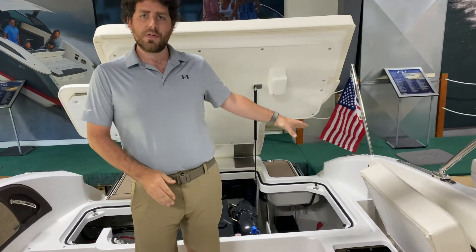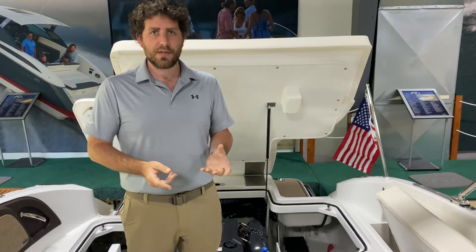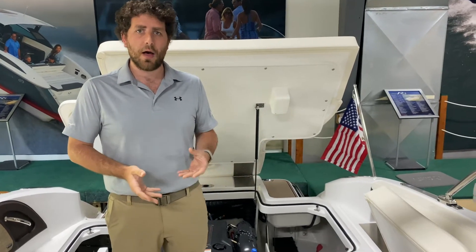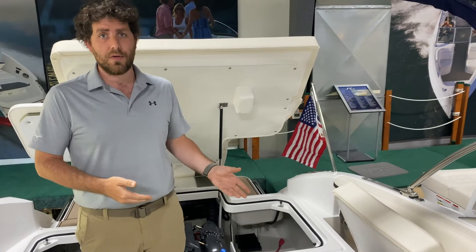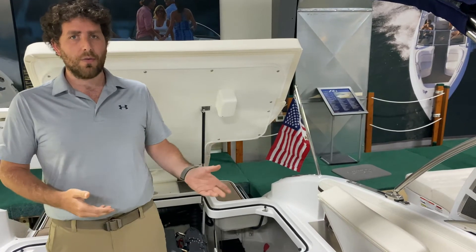In these types of battery setups, one battery is tied directly to the engine, while the secondary battery is used for the electronics, such as your stereo, your GPS, your lighting, and any of the accessory options that you have on board. This is done so that if you're running your stereo during the day while you're out on your boat, or other options, you don't have to worry about it killing your engine battery and being stranded out in the water.